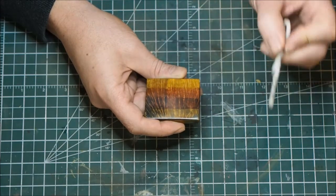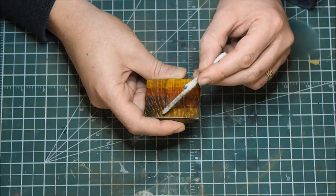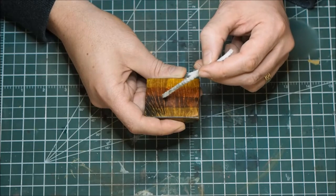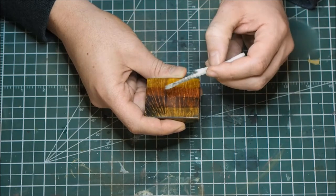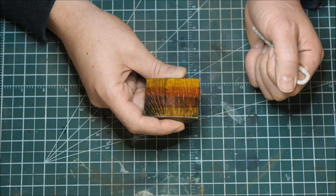The conclusion I've come to is that the bleach actually opens up the wood pores. I think it allows the stain to penetrate a little more deeply in the soft areas of the wood, which allows it to go a little darker than it would otherwise and gives you a stronger, more contrasty look than unbleached. So if you want contrast, bleach your pipe. It's certainly an unexpected result, but I'm pleased with it and I'm going to experiment more and see if I can apply this to my rock pipe — that'll probably be another video. Until next time, happy piping.